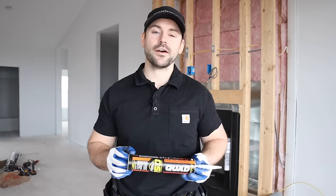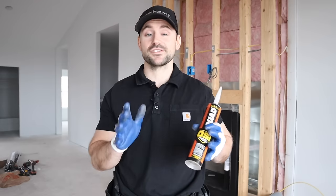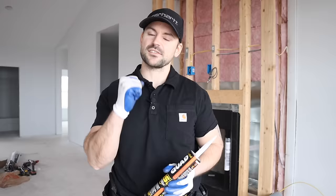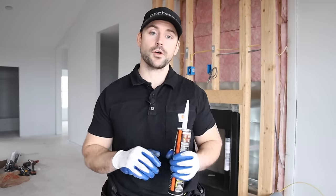If it wasn't raining I'd show you how to seal around the black iron pipe using quad caulk where it went through the siding — it's for windows, doors, and siding and I highly recommend it. I could have used CSST or soft copper for this installation, but I really like the black iron pipe because I feel it's a solid product that's going to be there for a lifetime. If you want to see how I installed PEX pipe, check out that video — it'll help you out.